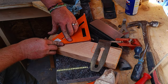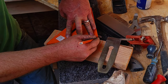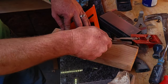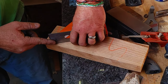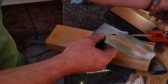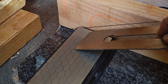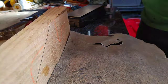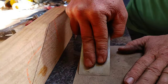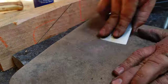I'm gonna take this speed square and move it to 60 degrees right here. This will give me a reference to look at while I'm sanding, because it's gonna give me a 30-degree angle on the cut. I'm putting this right on the granite so I can use it as a reference to sand back and forth when doing this bevel. This little line is an easy way to do this without a jig or anything purchased, and it really does keep track of the angle pretty well if you're paying attention. This angle was pretty bad — I think it was modified to be a scrub plane at some point, but that's really not what I'm using it for.